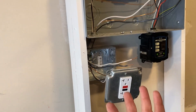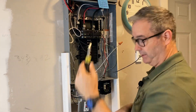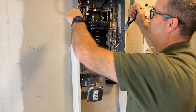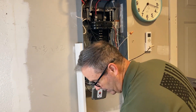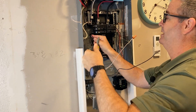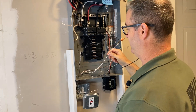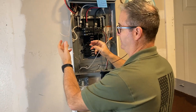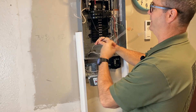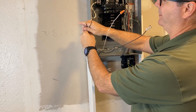I've turned this off and we'll undo some of these - some need cutting and stripping. These are the wires going directly to the appliance. The other places you can apply this: if you're working in an older house, maybe they don't make those breakers, or maybe with supply chain issues you simply can't get them. We've had lots of issues finding certain size Cutler-Hammer breakers, so we have to find workarounds.